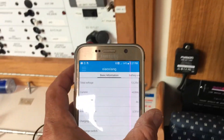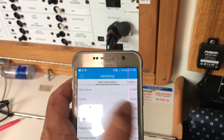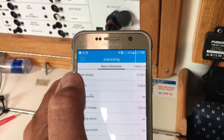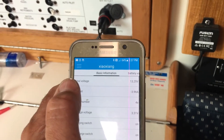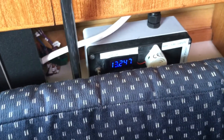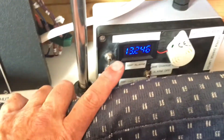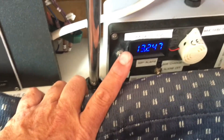That's my understanding — not expert opinion, just some random testing. The other thing is this system has a BMS, and the BMS could shut the lithium down. If you're trying to navigate and running autopilot, it won't be good if the BMS shuts down the lithium batteries. You cannot count on this lithium battery output of 13.2 volts because it could just go away if the BMS has a fault.